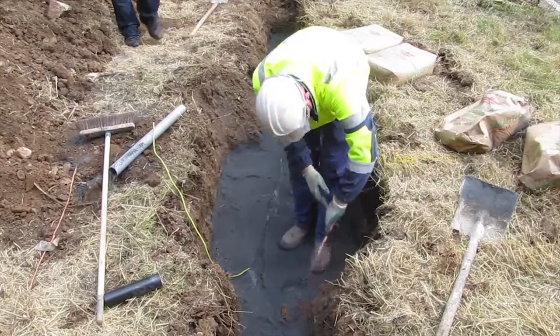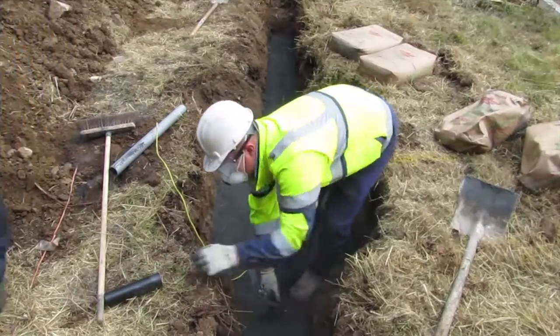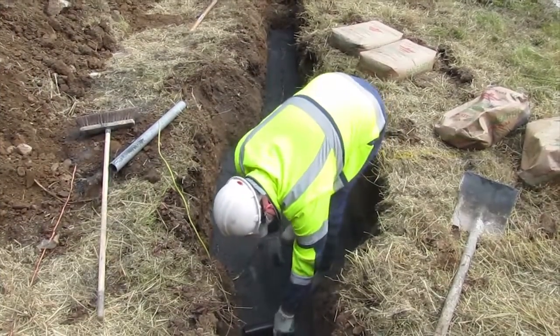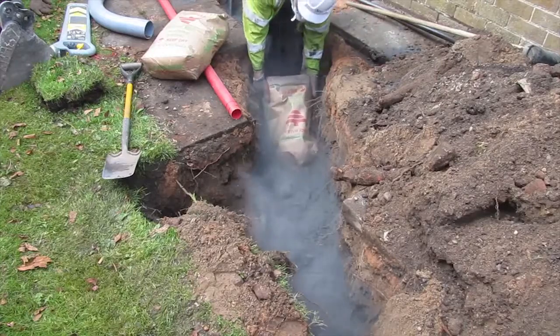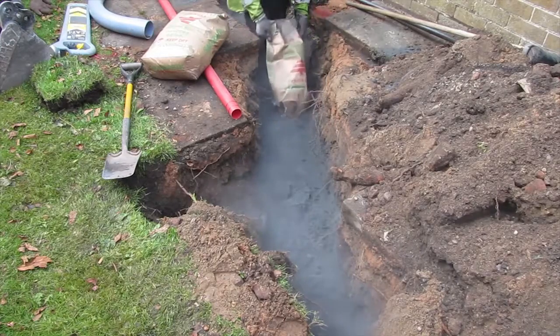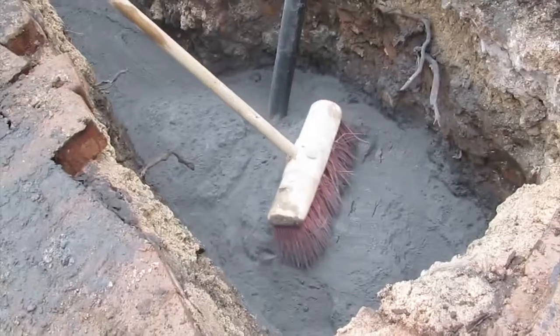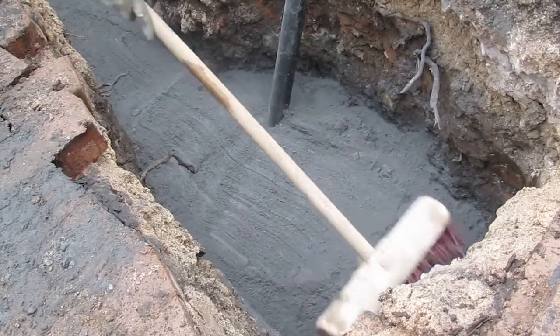If the spare tail is unused, coil it into a piece of black duct 36, minimum length of 200 mm, for future use and cap with a plug. Ensure that the plugged end is free from the material to allow future access. Spread the contents of the 2 remaining bags of conductive concrete across the bottom of the excavation, taking care to ensure that the copper electrode is surrounded by the material. This can be done with a broom to avoid disturbing the electrode.